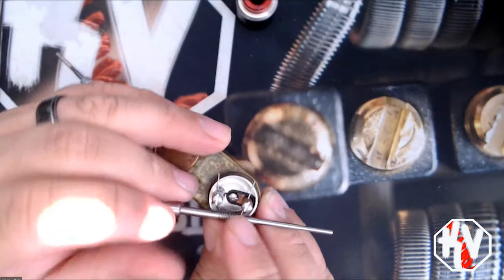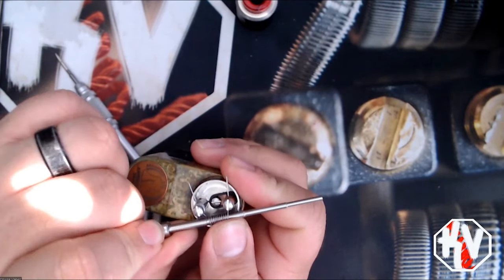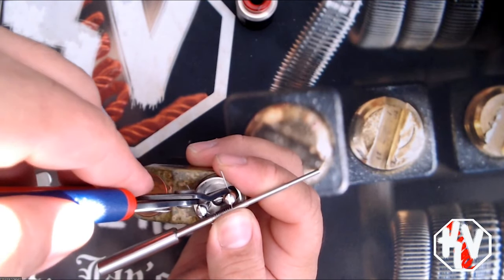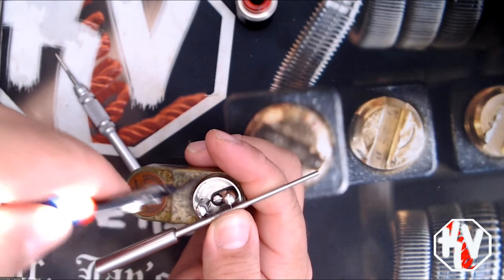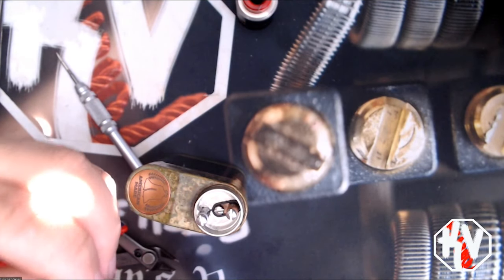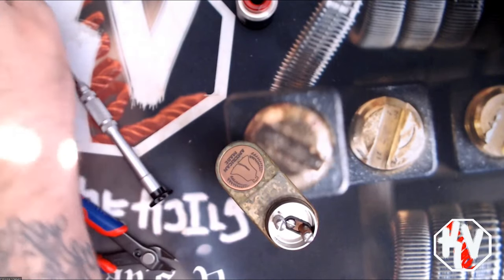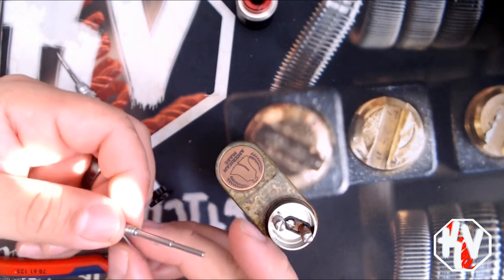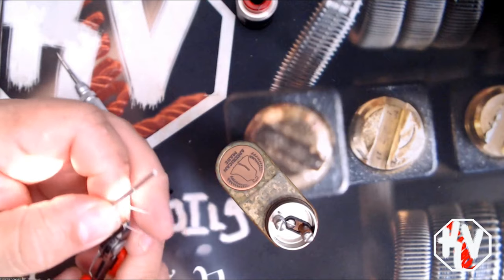But even then, you got to know Ohm's law, you got to understand how series builds work. These were not designed for crazy low ohm builds. They're powerhouses, but in a different format, not in the sense of they can handle low builds. That really could spell disaster for you, and you have to be very careful. I'm not trying to get lecturous right now while building this thing, but might as well get that out of the way, because why not?